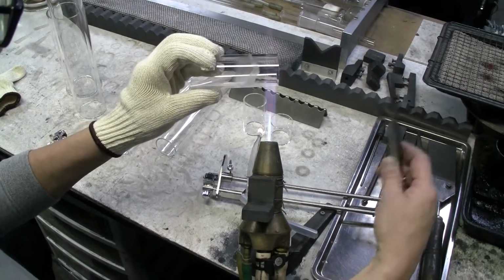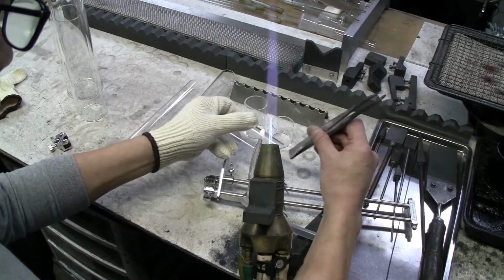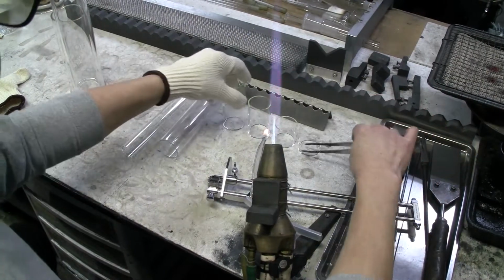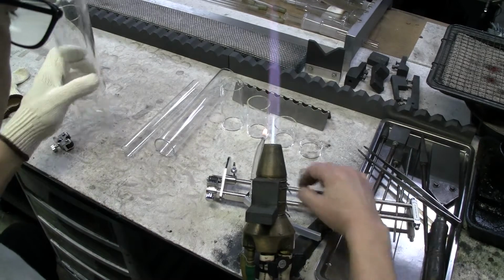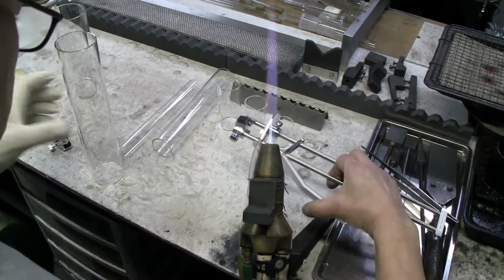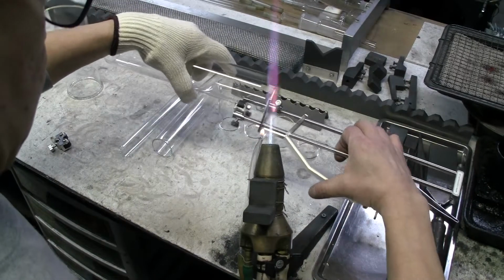If a crack never forms, the flame was too small or too cool, or the glass had residual strain from prior heating. The ideal flame is too cool to fire polish the tubing end, but not so hot that heat check cracks form on the freshly cut end.